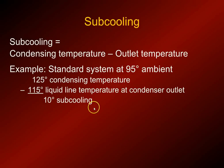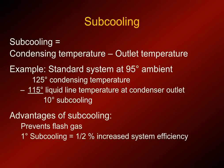In this example, we have 10 degrees of sub-cooling. You really need sub-cooling because it prevents flash gas — that's when the refrigerant starts to flash from liquid to vapor within the liquid line before it hits the metering device, causing you to lose cooling and freezing capabilities. One degree of sub-cooling equals a half a percent of increased system efficiency, which really saves money in supermarket refrigeration where gaining 1% or 2% efficiency on large systems can be a considerable savings.